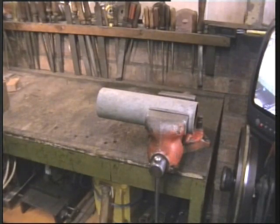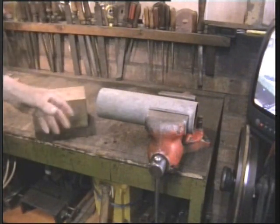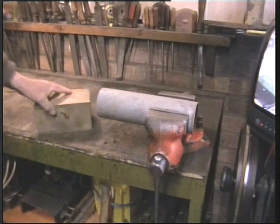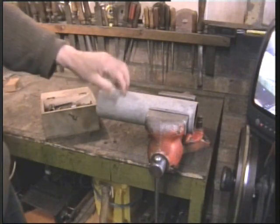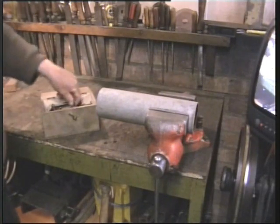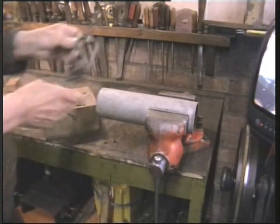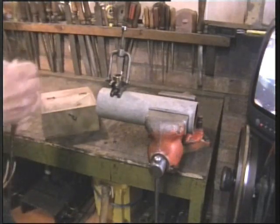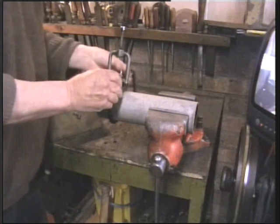Okay, while still on the pipe theme, here's a big piece of pipe, well, small section, but 3 inches, 3/16 thick. A little tool I picked up many years ago is for drilling, tapping and putting fittings into such a pipe. But you can do it in situ. You don't have to physically cut the pipe. This is a lovely little tool. That's one piece. That sits on the pipe like so. And you have a chain. Chain goes round the pipe to fit whatever size pipe you're doing, of course. That's the bit that tightens it up.